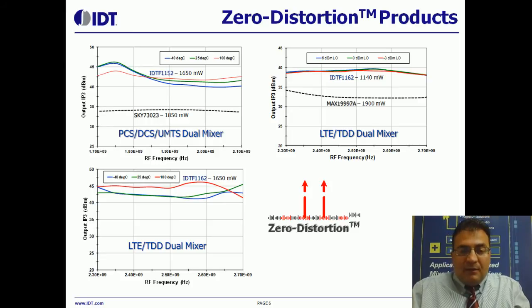On the lower left graph, if we take that same device and configure it for standard mode of operation instead of low current mode, we can get another improvement of up to 42 or 43 dBm Output IP3. We can do that with only an increase in power consumption of 500 milliwatts, still less by 250 milliwatts than the competitor's offering. It's important to note from these graphs also that the performance at 100 degrees Celsius is actually even better than at room temperature.